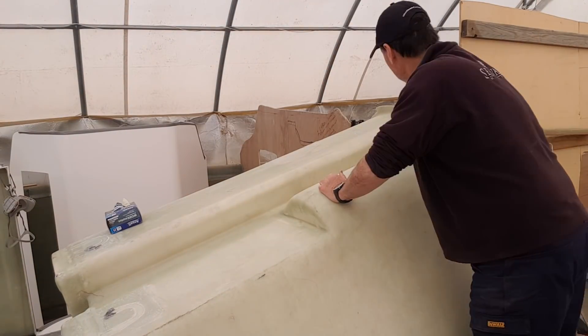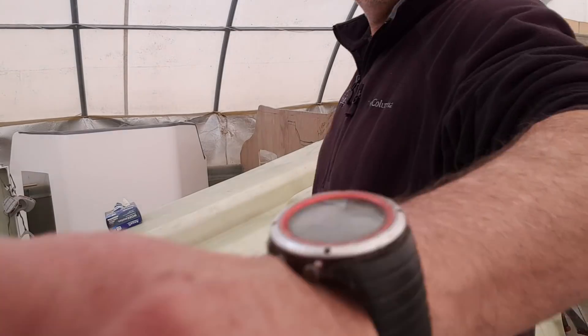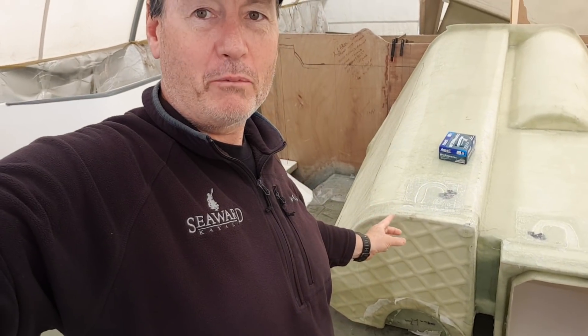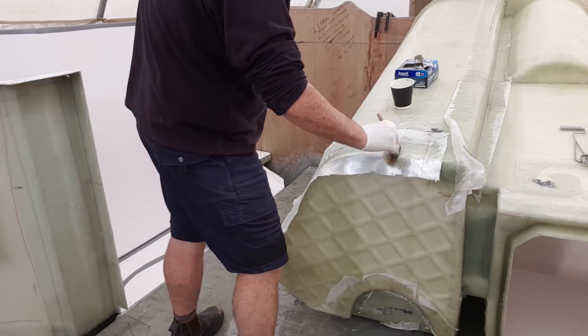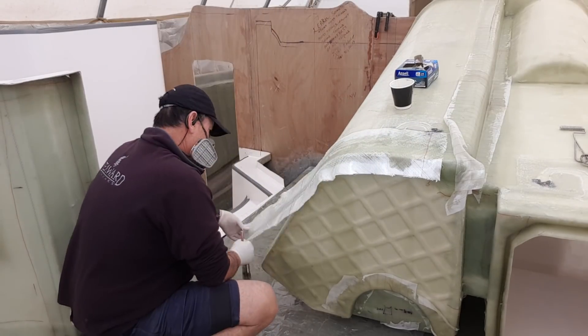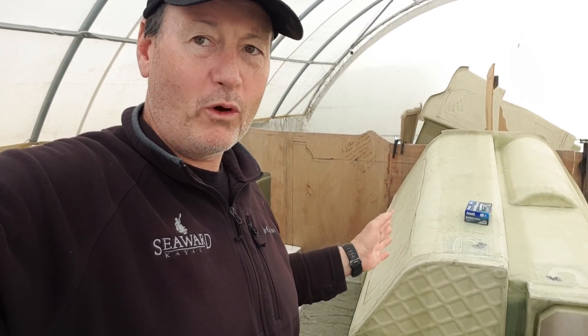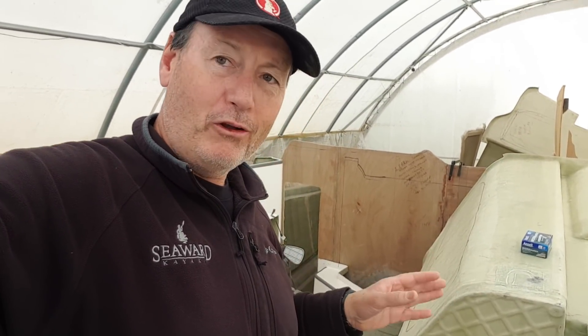I've sanded up along this line here — all the way up into this area that needs reinforcement, a vertical member of the head. Remember all these big faces will have hatches cut in them with foam strips behind them, tying them and epoxying them together. That's actually how I'm reinforcing this without building too much thickness into the module — I'm going to use laminated foam strips like studs in a wall frame. I've spent a good hour or so sanding this morning; it's smooth enough to run your hand over. Then a quick wipe with styrene and I'm ready to laminate all these strips in.